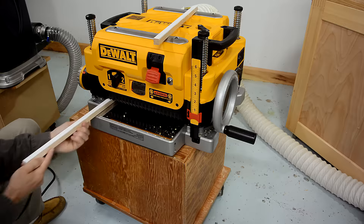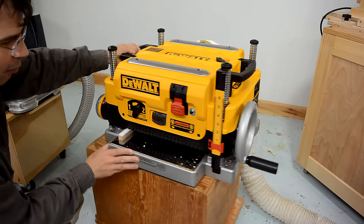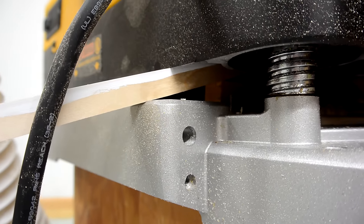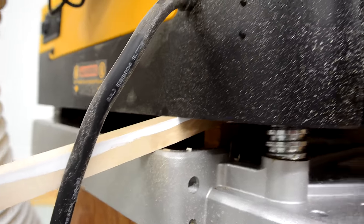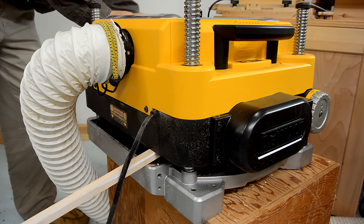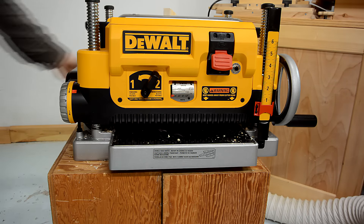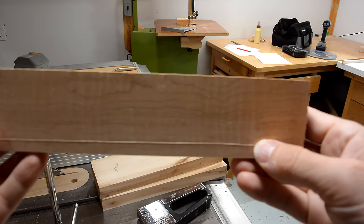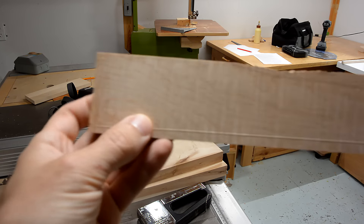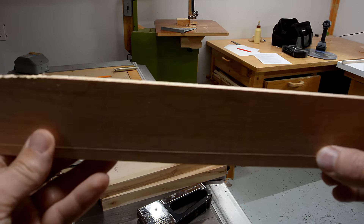I'll try my other two pieces as well. My workpiece got stuck — another piece got in at an angle, and then that piece got stuck underneath it and nothing would go. This is a known frustration with a DeWalt planer. I ran this piece afterwards and once again I really can't tell where I ran the painted stuff through. So this amount of paint — at least for acrylic paint — appears to be okay.